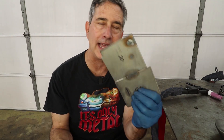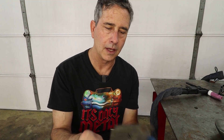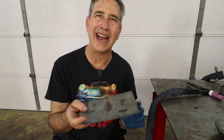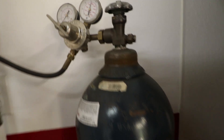This welder works just fine at welding 20-gauge steel together. This would be a great weld on your car — an exterior body panel, whatever. This is 100% penetrated, needs very little grinding, and it's clean on both sides. That was 29 amps, DC electrode negative, argon flow rate at 15. Right out of the box, it worked great.